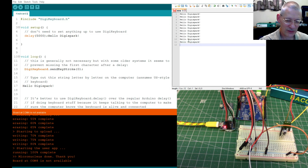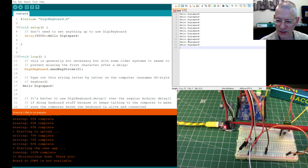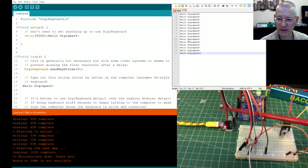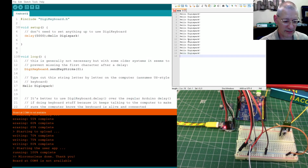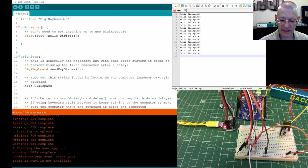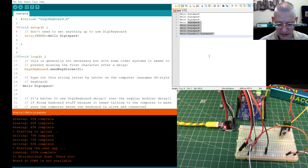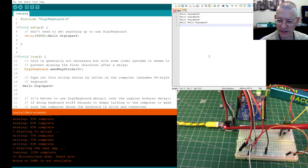So there we are though, without doing anything at all on here. So we've done nothing, have we? All we've done is plugged in the USB cable and it immediately identifies itself to Windows as some kind of USB HID, human interface device. And it accepts, or Windows accepts I should say, input. So this stuff being written to via this thing now, and the stuff you're watching in this window here, this is Windows now you're looking at. It's communicating via the USB port over here.